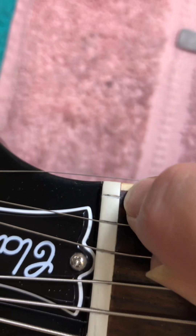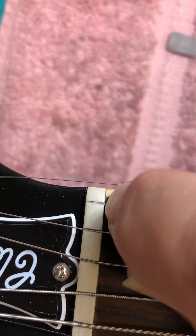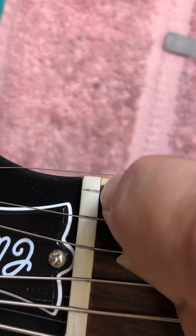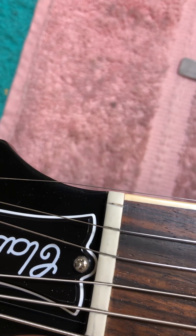When I first did it, there was a black mark on the front edge. And when I hit it with the file, the file was not touching the front edge on the bottom — so I knew that the slot was worn down on the front edge.